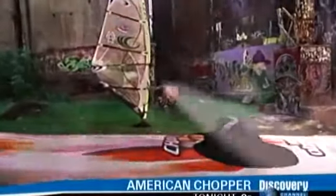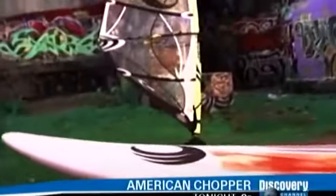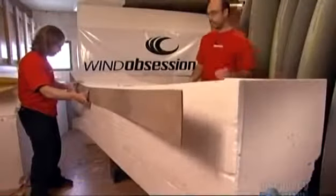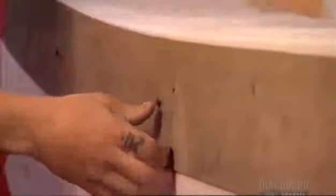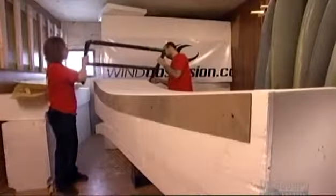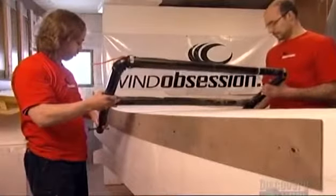American Newman Darby built the first sailboards during the 1960s, rigging a sail to a mast on a board with a tail fin to ride the wind and waves. Today's windsurfers can pay several thousand dollars for high-tech gear including a sail, a mast, and a sailboard. To make a sailboard, workers start with a long block of styrofoam. They attach a wood template, pushing nails through holes in the wood and into the block, then use an electrically heated tool called a hot wire to slice the block along the curved template line, producing what's known as the core.